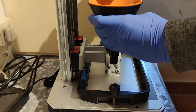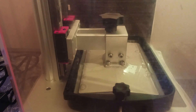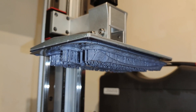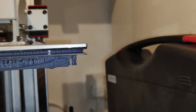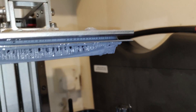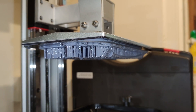So I did another test print. About halfway through the print, I noticed a big problem and cancelled the print. Like all resin, this stuff shrinks a bit when curing, so on large thick parts the shrinkage can be more noticeable. With the wide base layers, the shrinking strength was so powerful it pulled the flex plate away from the magnet at the edges and warped the print. It's only luck that it didn't fall down and crack the newly placed LCD screen. This clearly would not work. I have been told that these magnetic beds tend to only work on the smaller printers and the sheer pull is too strong for these larger format printers.